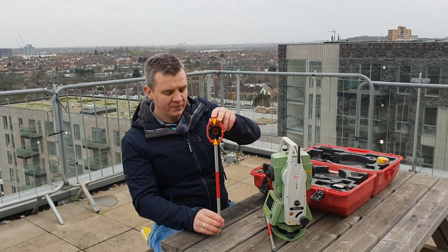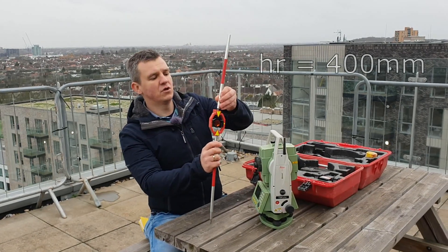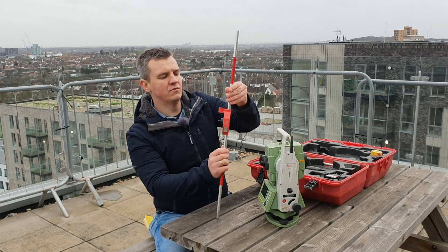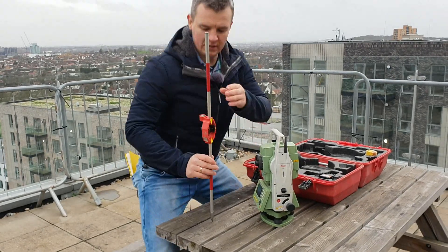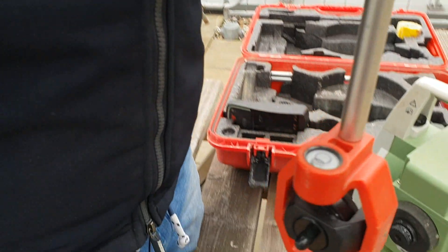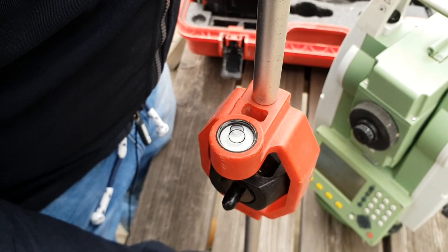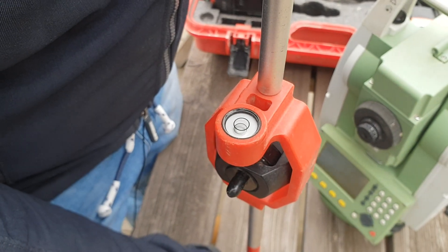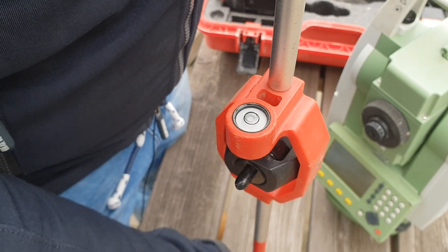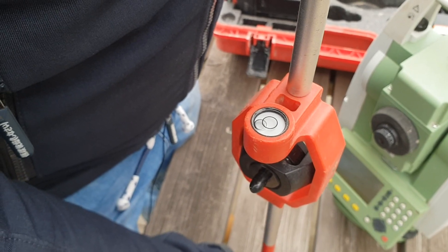So with that 50mm offset and 300mm pole sections, the total distance here becomes 400mm. You attach one more pole on top of the prism and that's the way you're going to be holding it. There's a bubble as well — just make sure your chainman or assistant is holding it level. That's the way you're going to find and shoot your target.